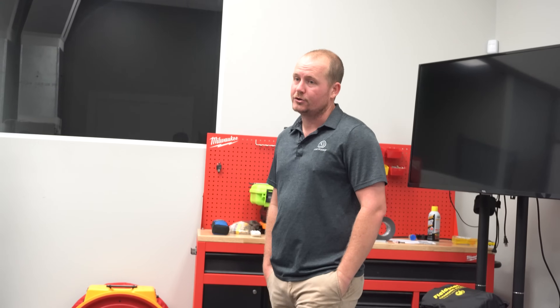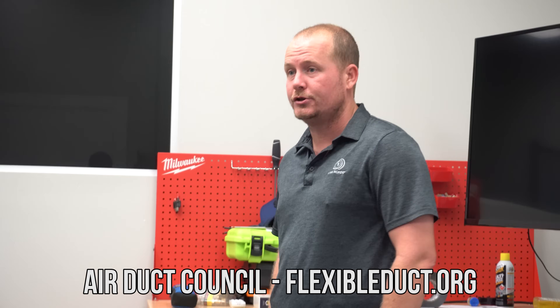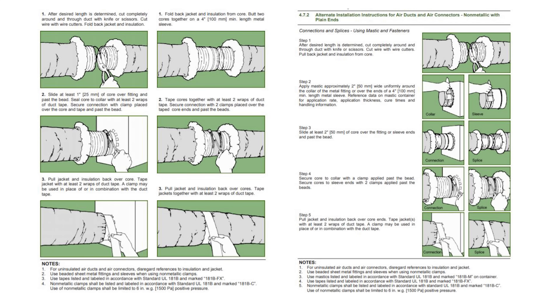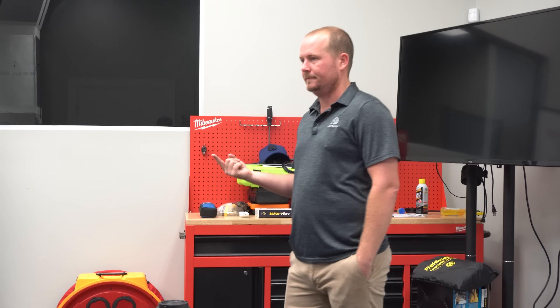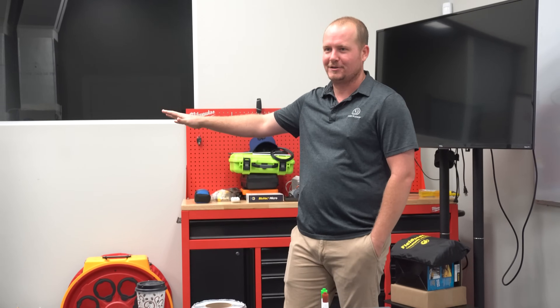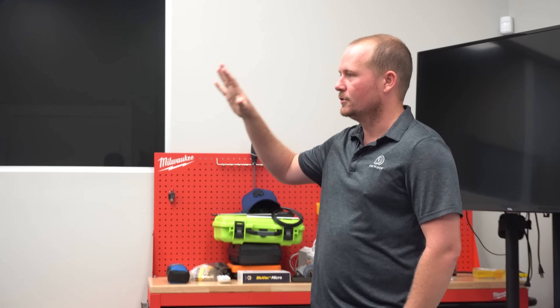Visual cues include tears, sweating, and discoloration. Another thing people look for is mastic on the outside — but truthfully, mastic on the outside is really just a shortcut way that inspectors in our state have come to view duct sealing; it really isn't a standard. In fact, if you look at the FlexDuct Council's two ways of attaching FlexDuct, neither of them include mastic on the outside. Mastic on the outside of the duct is not how you seal a FlexDuct — it's not that it's pointless, because anything that helps you pass inspections still has a point, but it's not what results in a FlexDuct leaking.